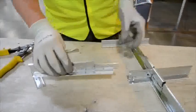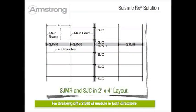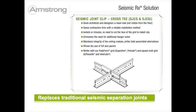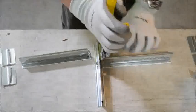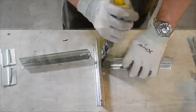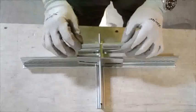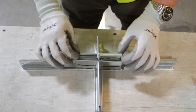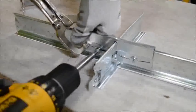The holes in the other side of the clip are designed to mate up with the opposing main runner. When breaking off 2,500 square foot modules in two directions for large installations, the SJC will manage the expansion required at the cross-T locations. You are ready for this only after your grid has been installed wall to wall with all lateral force bracing installed — this prevents any movement once the mains or T's are cut in the ceiling plane. Screwing through the clip slot but not too tight ensures adequate movement in a seismic event.